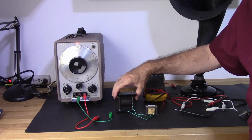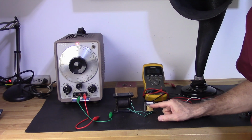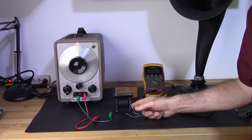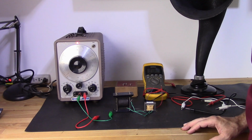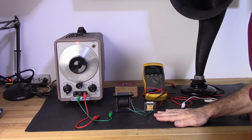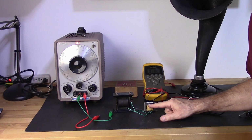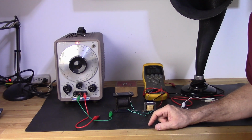So I'm going to go ahead and install the PT431, which is just the coil, into the iron core of some Chelsea transformers, and I'm going to use those to repair my Chelsea radios. Now the whole purpose of this entire testing was to basically make it so that I feel comfortable with replacing this core with this core. And the reason why is because after unwinding this core, I realized there's no way, absolutely no way, I could wind a core this complex.